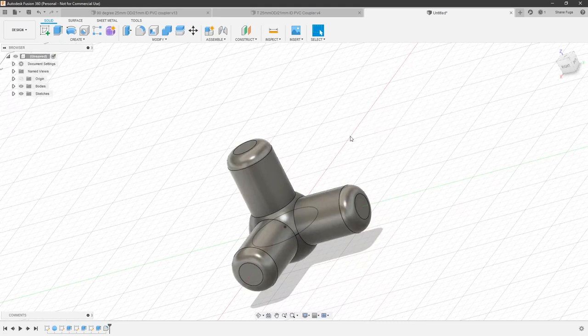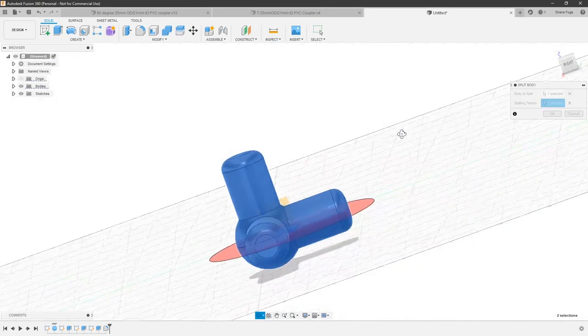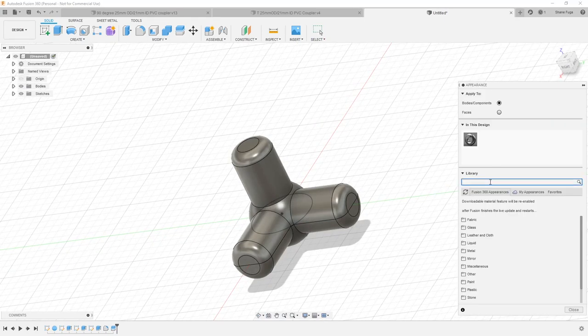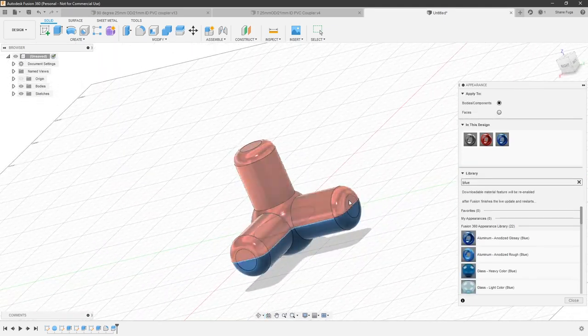Now this isn't very easy to 3D print as-is, and that is a problem. We need it to be easy to 3D print with no support, yet still be strong. We can't make it perfect unless you print one of these pegs separately, but we'll get close. So we're going to go to Modify, then Split Body. We select our body and the splitting tool is going to be the XY plane — we split it right there, hit OK, and now we have two bodies. If I put a color on here you'll be able to see the two bodies more easily. Both have a flat surface, and just a little bit of CA glue joins them.